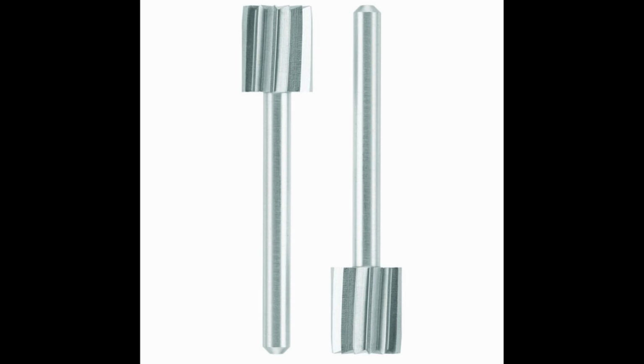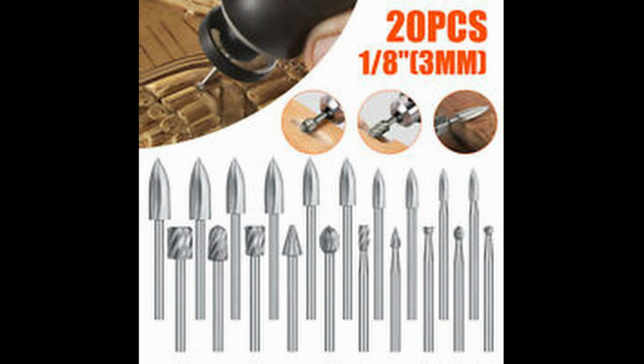I don't use these, and the reason I don't is they don't cut well. They wear out fast, and then they burn. They look sexy because they've got these cool grinds on them, but I just have not found a Dremel bit that was worth it, although they're only $5, $7, $8. Now, Dremel does have this wood carving line out, and they even have beautiful pictures of people carving with them, their little spear points and whatnot. And Jordy has used a few of these, I think, and they come in a set like this. I might get a set to try them out, but by and large, I'm not a big fan of the carbide. And I don't use the Dremel or the Foredom, although you can get the stuff out there.